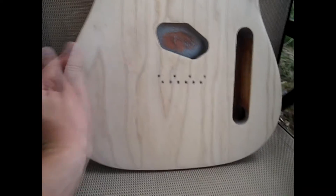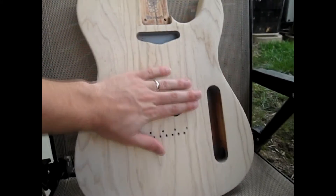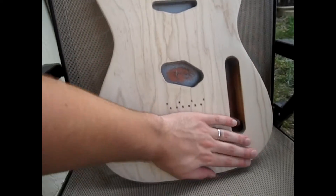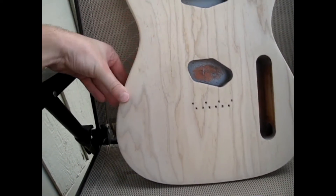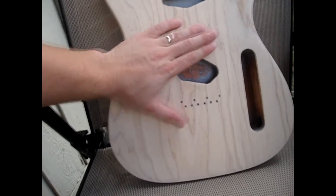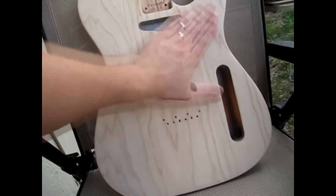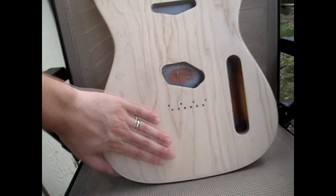It feels and looks — there's a big difference, a big improvement I would say. At first I wasn't really excited about this stage of the process, but it has really made a big difference. Before it was very harsh and sharp — 60 grit is some pretty heavy-duty sandpaper — but getting down to 220 has really made it smooth. It almost feels softer or lighter somehow. It feels a lot smoother, a lot clearer, and I feel like it's going to take the finish much, much better.